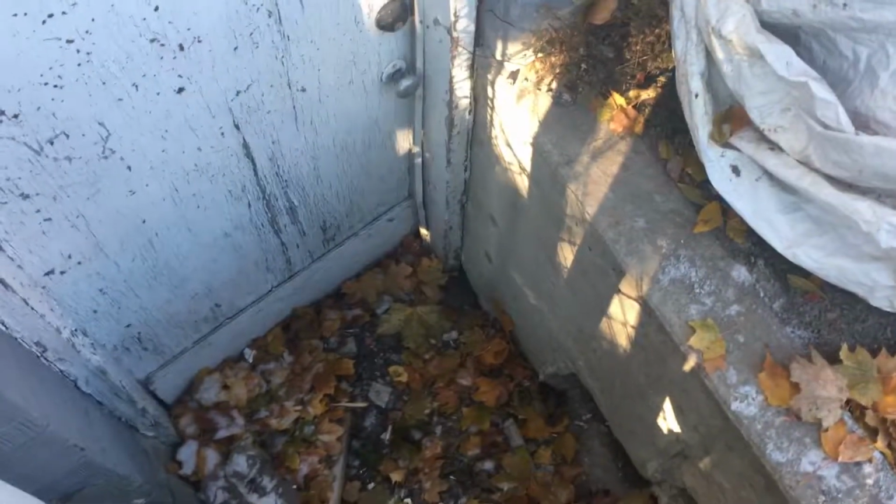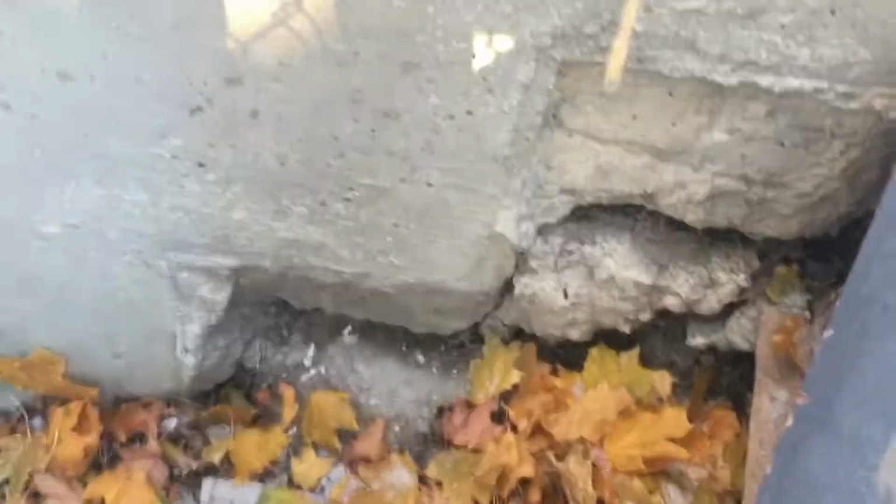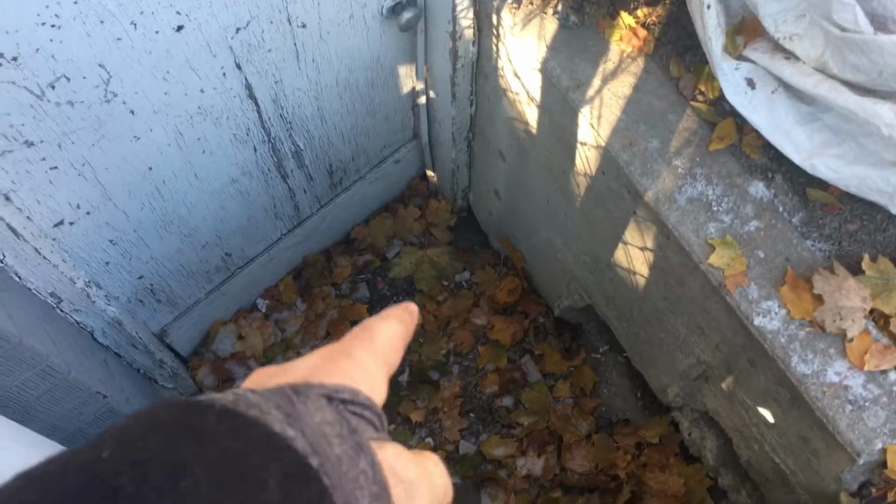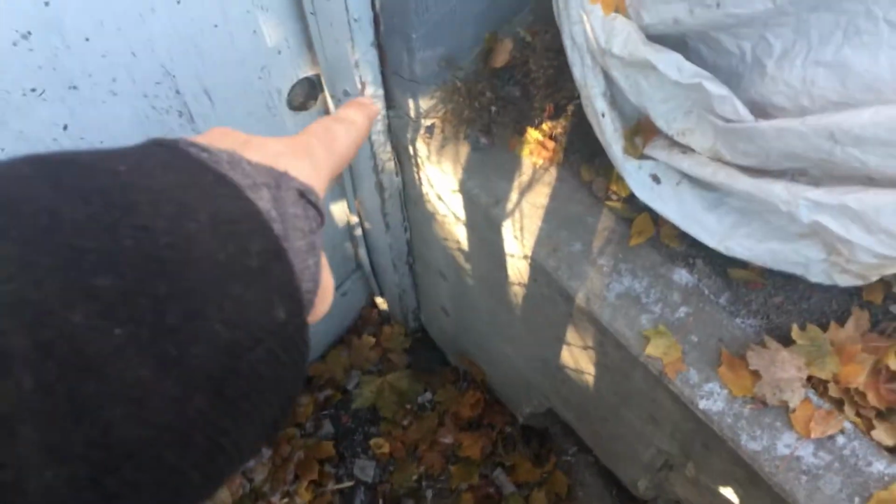I mean, it wouldn't be a terrible idea to have a sump anyways, just to pick up any groundwater that's in here, because I can see in looking at it that at the bottom the concrete doesn't go all the way down, and there is earth under here that eventually is going to take on some moisture from rainwater at the front here, rainwater underneath where the AC is. It's going to take on water, and it's good to give it somewhere to go. So I think maybe either in replacement of or in conjunction with perhaps some weepers that drain into the house to a sump pump and pumping it out as far as possible.